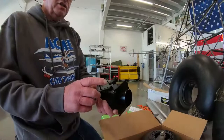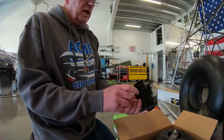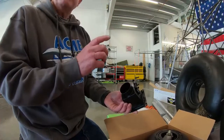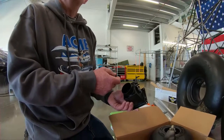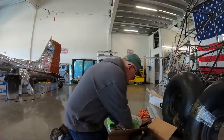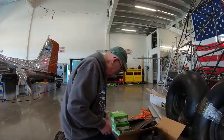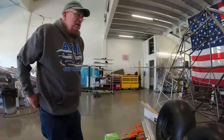We're going to put an F. Atlee Dodge rear seat heat kit in it. The way I do it is I have the new rear seat heat box go to the front seat passenger and run a two-inch scat tube back, using the normal heat for the rear seat passenger. Since I'm a flight instructor I don't like the scat hose under my rudder pedals, so I switch who gets which heat — I never get to ride in the front seat anyway. That's about what we have today and we'll have lots more probably next week as we put the parts together.